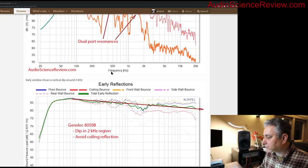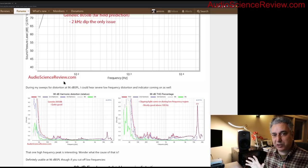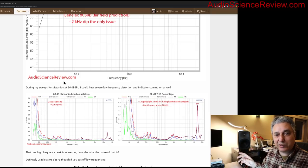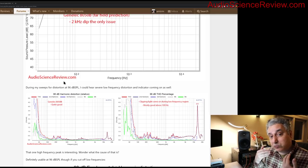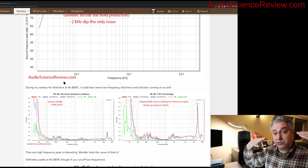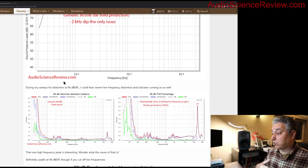The science essentially says tonality is everything in a speaker — it dominates preference. If one speaker has boomy bass and another doesn't, you're not going to like the boomy one regardless of its lower distortion elsewhere. In controlled blind tests, if you have two excellent speakers with similar frequency response and similar early window, then distortion matters and we want to find the limits of a speaker.